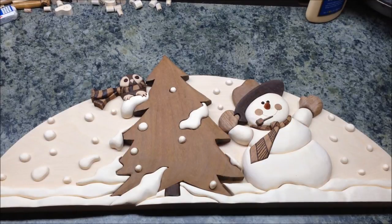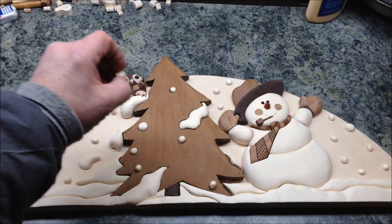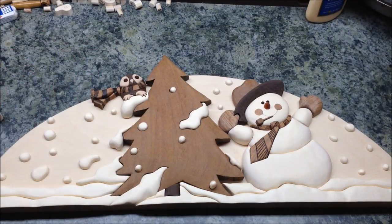I've got the background cut out and I've laid everything out — I'm really happy. I've got two things I need to correct. One is this piece of snow right here — I had trouble in one of the earlier vlogs with my scroll saw and this bottom piece of the tree ended up a little shorter than it should be, so I'm gonna remake this piece and lengthen it about an eighth to a quarter of an inch so it fits tighter. Also this snowflake up here doesn't fit real well, but I found another snowflake — all I need to do is round it off and it fits perfectly. I need to stain the background, then decide on my finish, get it finished, and I'll be ready to give it to my wife.